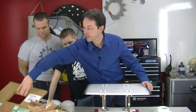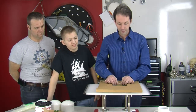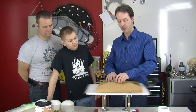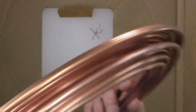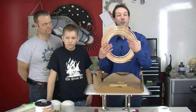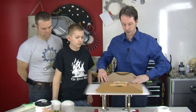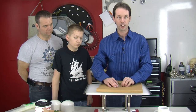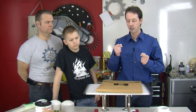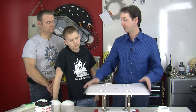We got the other big copper. This is 50 feet of quarter-inch OD — because it's tubing, not pipe — 50 feet of quarter-inch soft copper tubing. This is our already half-wound primary coil right there, ready to go. When you work with copper, this is an important thing to remember: copper exhibits a property called work hardening, which means every time you bend it, it gets a little harder and more brittle, and eventually it'll just snap like a twig. So leave it in a box — don't mess with it. When we're ready, we're going to make the mounts, then wind our primary, and then we're pretty much done.